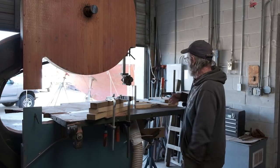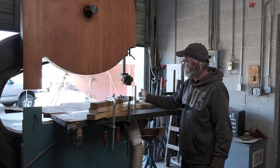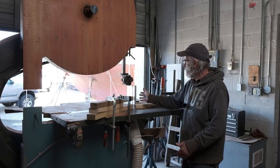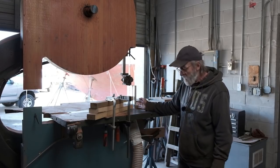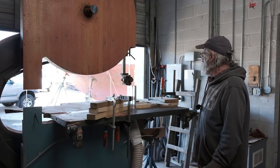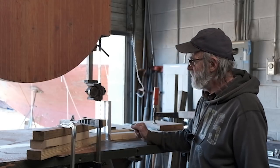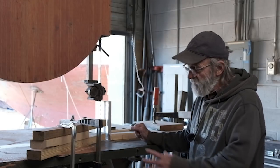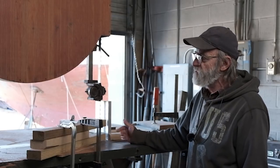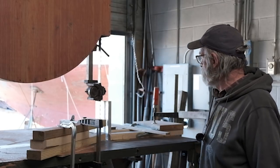The fence is mobile — I can move it all over the place. I've got one clamp holding it down and another piece of wood on this side so I can skew that fence. Rather than like on a table saw where the fence stays perfectly parallel to the blade, this one I'm able to skew it, and it's skewed quite a bit actually, but when you saw, it saws perfectly straight. I've got the guide down as close as I can get it, the fence holds it up a tiny bit, but we're all set up to go and we're going to do a little ripping.